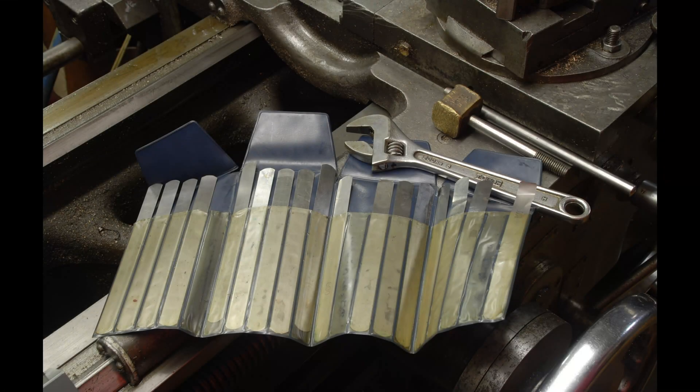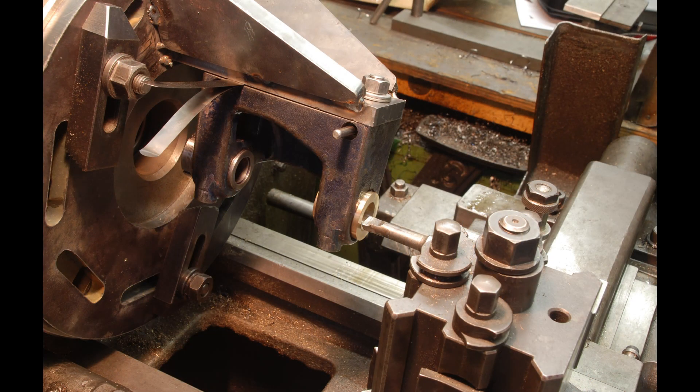A good selection of loose shims is pretty important for doing this, and in this photograph you can see these shims in one plane. On the other side of the headstock there's a lip that abuts to the front of the bed, and I've got this aligned with or abutting against the edge of the plate that the headstock is bolted to. The idea being that if I get it aligned in the plane as shown in the photograph, the shim should stay in place when I subsequently go and start shimming between the lip on the headstock and the side of the plate.